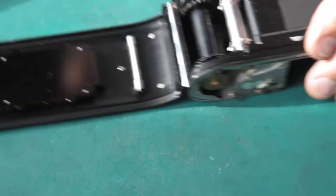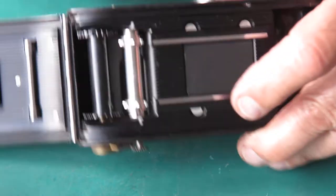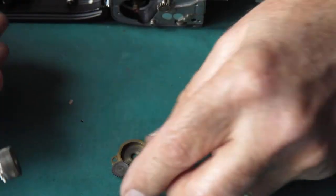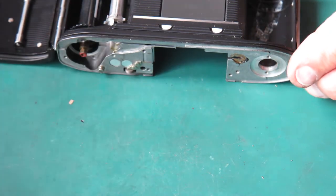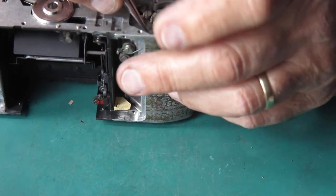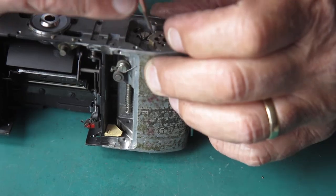The spring to one side, the button and the washer somewhere else. The screw through here that drives the sprocket from the sprocket shaft — we'll have that out. And while I'm working on this, more film chips are falling out. Well, that was the bush from the film advance, and here's the clutch. Take out the shaft from the sprocket, put the sprocket to one side. The film advance shaft here — just rotate this so I can see the fixing screws. This is very sticky.